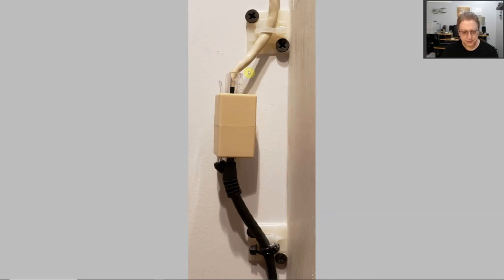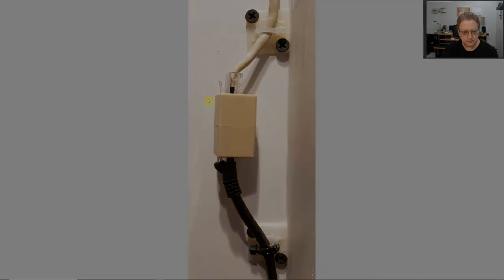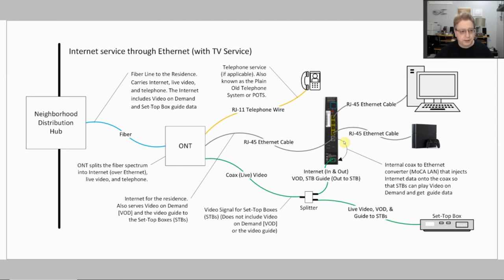What I've found in practice is that you tend to get issues if you go much over 100 feet or about 30 to 40 meters. If you need to do something like that, you need to start getting into specialized devices that can retransmit and re-amplify ethernet connections. That's beyond the scope of this video, but you can find help by looking up how people have implemented IP cameras or internet protocol cameras at considerable distances from the house using specialized devices.